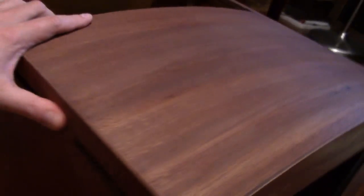Well, rather than cut out a whole strip across the whole top to patch in a new piece of veneer, I will just make some small patches and just glue them and press them down in there and sand flush. I don't think that'll really be too visible. This kind of dark here, I don't know what's going on with that. I think it's just down in the wood. Not much I can do about that. Here is a ding where the veneer is mushed down. I can try steaming that out. Otherwise, ready to go on with the finish.